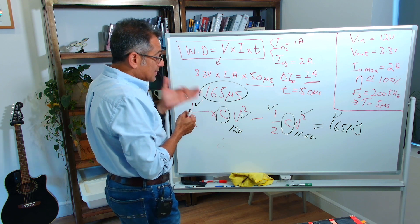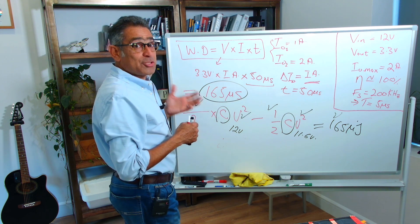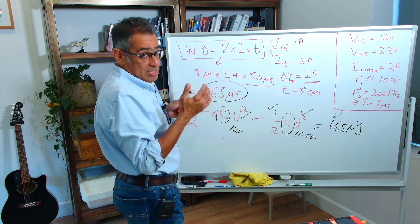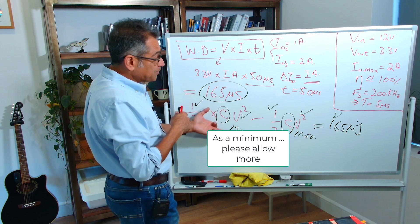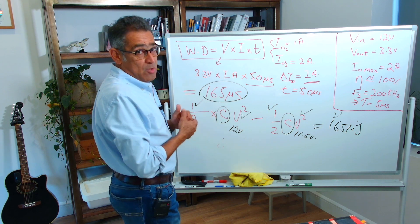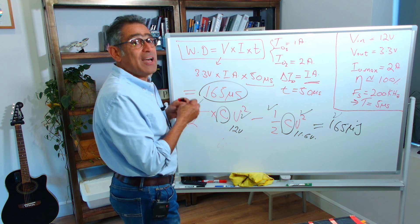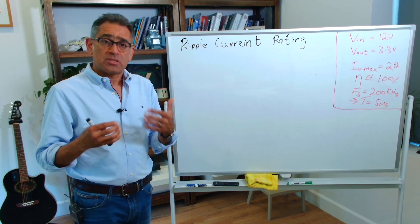For simplicity, let's say the result is around 20 microfarads. Note that electrolytic capacitors come with ±20% tolerance, so you'll need to buy 20% more than you calculated in case you get the minus 20%. On top of that, the voltage rating must be above 12 volts plus some margin — so you'd be buying a 16 or 25 volt capacitor. But we are not done yet, because we still have to work out the ripple current and make sure we don't violate the ripple current rating of the capacitor.